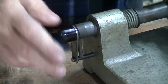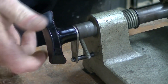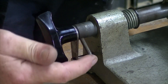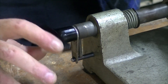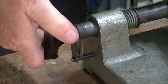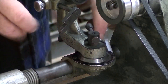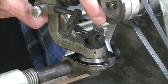So let's go through it. This end you've got a lock — you lock it in position and it locks this bar. You've got the first part of the stop here, second part down here. You can loosen that off and it will stop the tool from going too far in. You've got a spring here to push all the force that way. Next part you've got here is the protractor, so if you loosen that off I can get angles to the wheel.